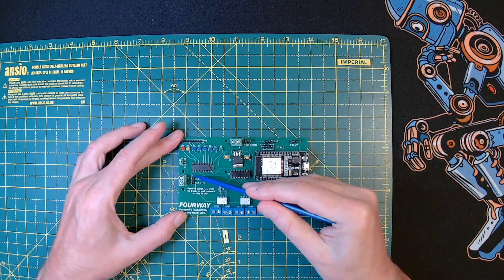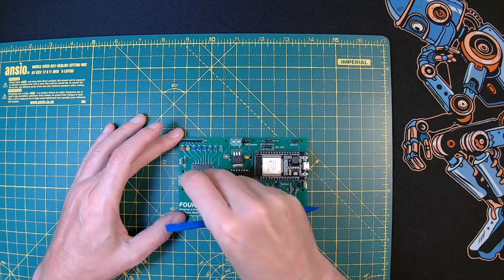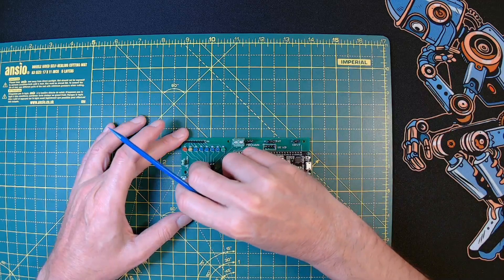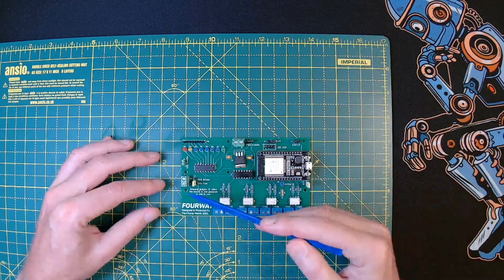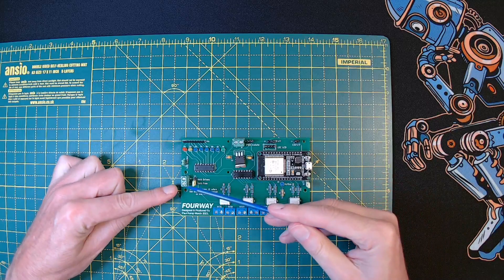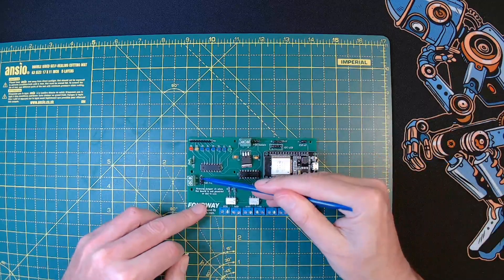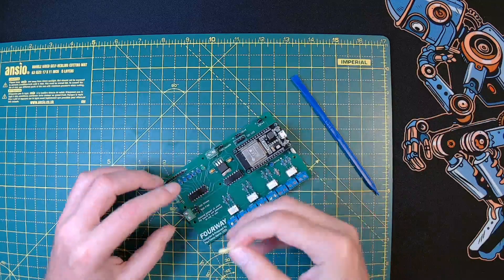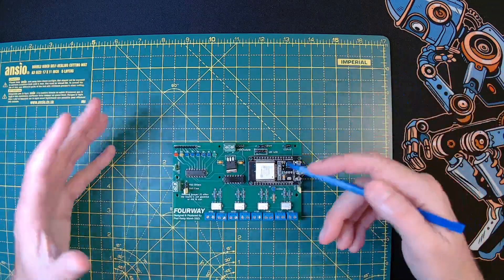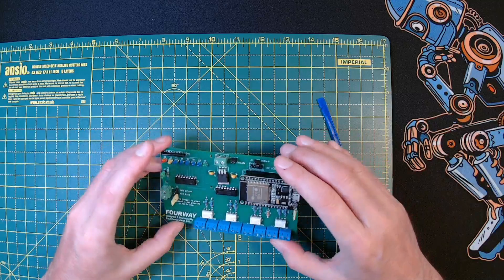This one I like because it's actually three pins, giving me three options. If I put it in the top two positions it's connected to those top two pins - this acts as a volt-driven device. If I put it down to the bottom it acts as a volt-free device, routing either the power coming in through these opto isolators to my outputs, or routing a ground pin through them. And if I leave the jumper off or just leave it on one leg, it's fully isolated - it won't trigger at all even if it's powered up.